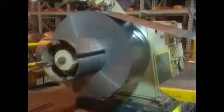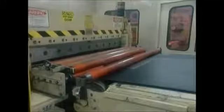Most of the parts are made from steel, just 3/4 of a millimeter thick. The factory receives it from the supplier in giant rolls. They go onto a machine that cuts sheets about a meter long. Using those sheets, industrial presses stamp out various dryer parts. These are motor supports.